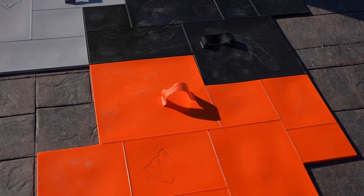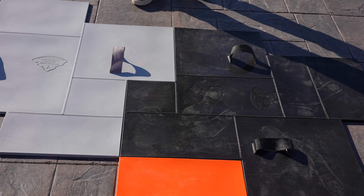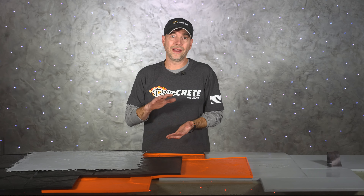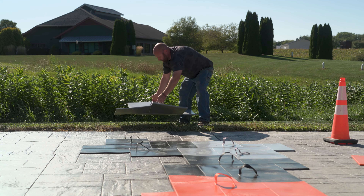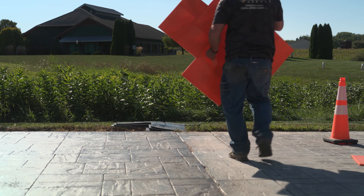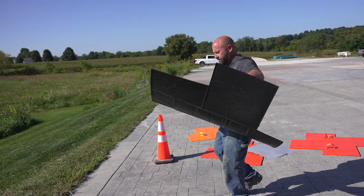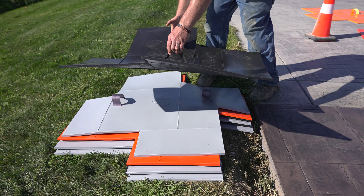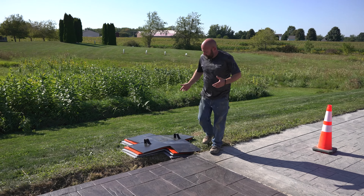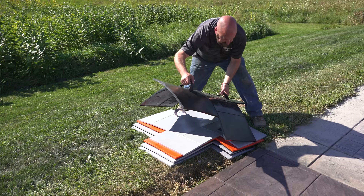Once enough release got built up on them they were just really hard to see anyway. These lines, on the other hand, are not going to wear off and they are easy to see even if you use powder release. One of the mistakes people make with grout line stamps is not getting those grout lines pushed all the way down, and this leads to bare spots in the texture — especially right around the grout lines — and that just sticks out like a sore thumb with no fix for it. Having the lines marked on the back will also help you if you have a job that requires multiple pours on the same slab, taking all that guesswork out of finding the right stamp and the right direction for the next section.